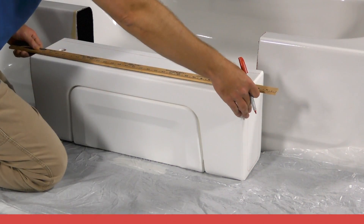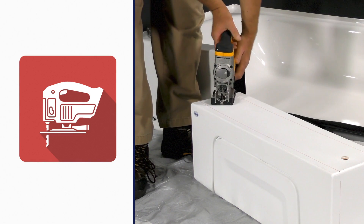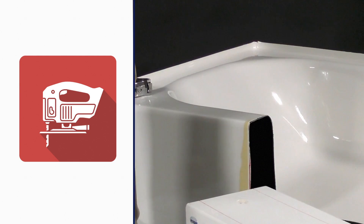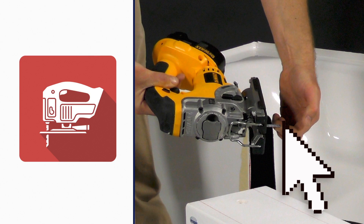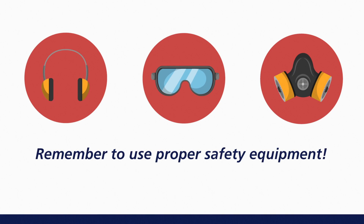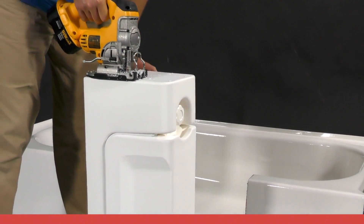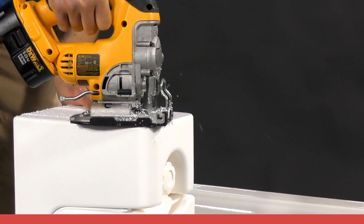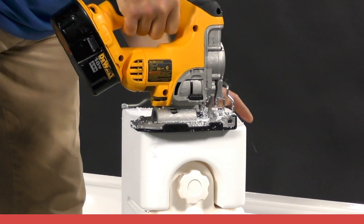As an alternate method, you can use card stock paper to create a bottom template. Cut the CleanCut product to fit the cut-out tub opening using a jigsaw. It is important that a two-inch blade is used to prevent accidentally cutting through the top of the product — snap off any excess length on the stock jigsaw blade beyond two inches. Proper eye protection should be worn while using the jigsaw. Place the product on the protective material and cut the bottom using the jigsaw, making your cut directly on the center of the traced lines. Upon reaching the corners, tilt the jigsaw outward to prevent cutting past your lines on the vertical ends, and remember to tilt the blade on each corner.